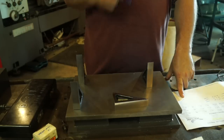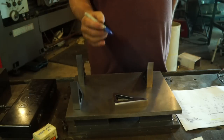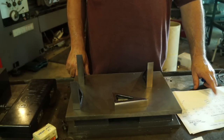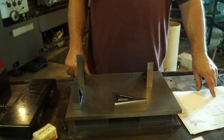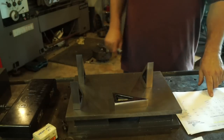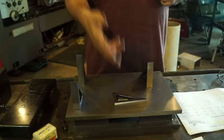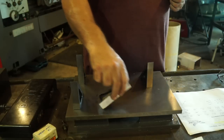The 60-degree corner is 59.9931 degrees, which translates into 59 degrees, 59 minutes, and 35 seconds — I had trouble reading my writing there. That converts to being about a half a thousandth out in five inches. So this one is pretty decent. It was the same setup as B2, which just goes to show how a piece of trash or contamination can cause problems. Let's go to the next one.